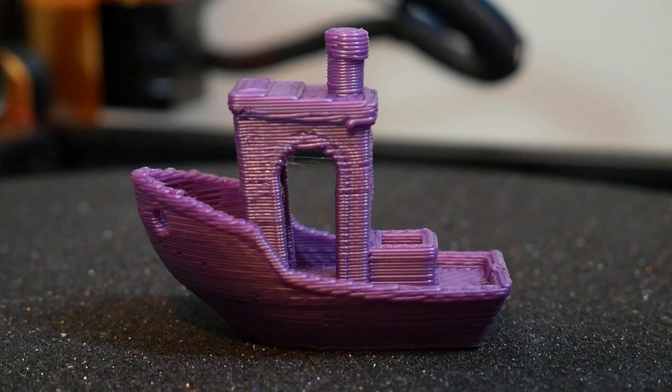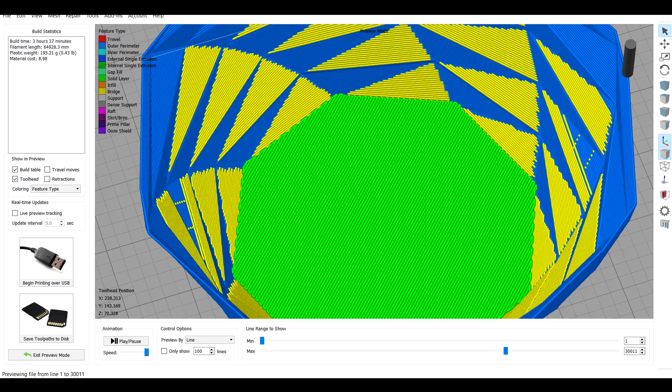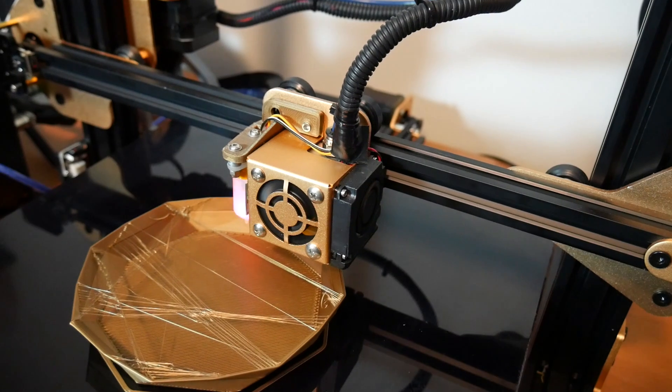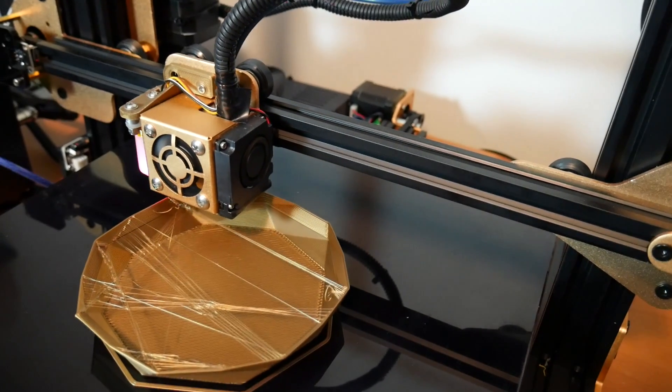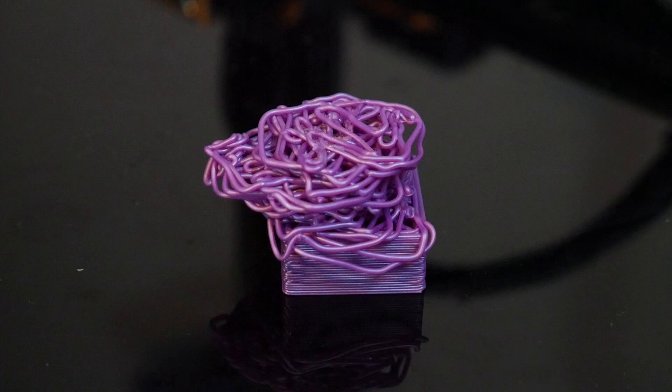So we know we can print fast and we know we can print strong. But what are the downsides? Firstly, we know we're going to lose some resolution on small prints, but it's probably not as bad as we might think. The altered appearance of your prints will definitely be an acquired taste — small objects look quite weird with such fat layer lines, but big objects actually look quite cool. Another downside is the slicing software actually struggles from time to time to process such different numbers to what it's used to. This big vase was actually printed at 0.49mm layer height instead of 0.5 because 0.5 triggered some sort of error where it was putting in random bridges everywhere. With stringing turned off in vase mode this was a nightmare — it was taking heaps of extra time and ruining the print. One other thing to note is that if your print does come loose and turns to spaghetti, that spaghetti is going to be very robust and strong.